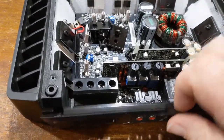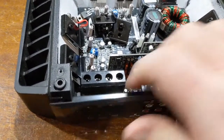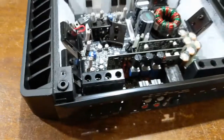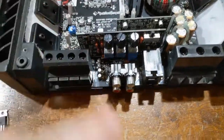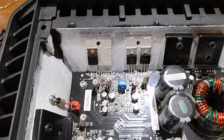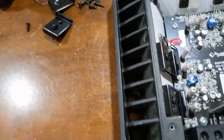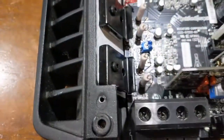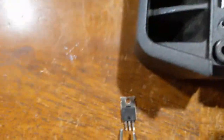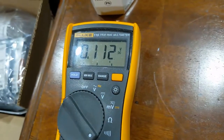All these covers come off. I've already got all the screws loose. Now that I got all the hardware dumped out and the front cover — or rear cover plate — off, this channel was the bad channel. I cut one of the transistors out because it was shorted. So I've got my meter on, and you can probably see that these are going to be hard to do with me holding the phone. But yeah, that's not normal. If I go from here to here — trying to do this single-handedly is impossible.